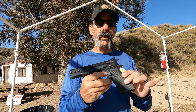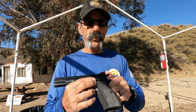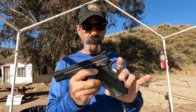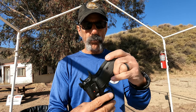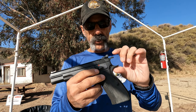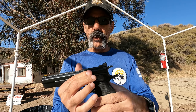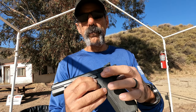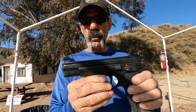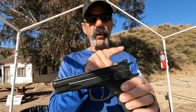This particular CZ is a single-action version of the 75B. I've done a few things to it that don't come stock. I replaced the grips, although the grips on the CZ are actually quite nice — I just wanted something a little flatter. It makes a really small, slim profile, as you can see, and it fits a smaller hand. I've pulled off the ring hammer and replaced it with this old-fashioned-looking spur hammer — I just like the way it looks, it doesn't do anything functionally. The oversized safety, which I believe they're now coming with. I swapped out the sights as well, which is not an uncommon thing with the CZs. In this case, I put a fiber-optic front, and this was a wedge — I just ground it down so I'd have a little lip on the top.